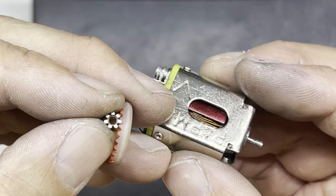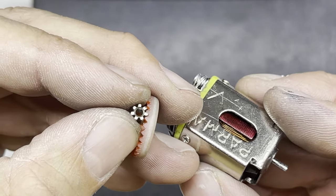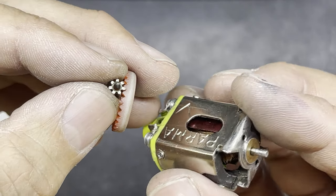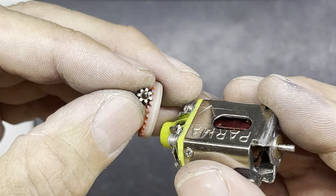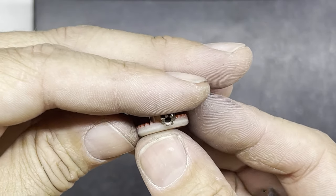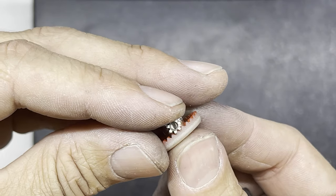So I think 7:28 will be a reasonable ratio. I might have been tempted to try a 6:28, bearing in mind that these motors are going to rev quite a lot, and potentially ultimate top speed is perhaps not what you want. But I also think the driver of this car is going to be racing on the outside lanes quite a lot of a track, so again needs a higher average top speed.